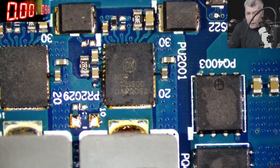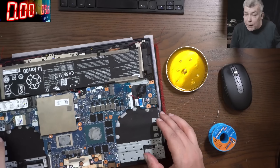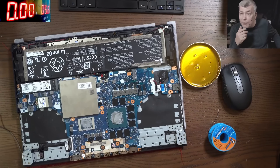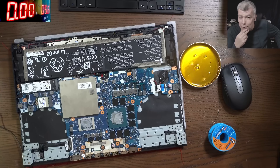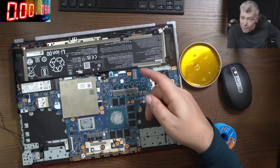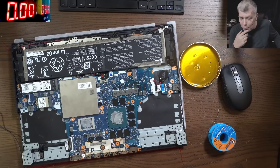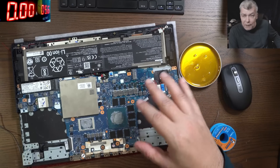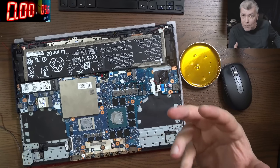After cooling down, we have to check if the MOSFET is working. To check if an electronic component is working you insert an ammeter in serial mode with the tested component and you can see the current flowing through it. The problem is we can't do something like that here, so all we can do is try to use the thermal camera, and based on the thermal signature we can figure out if it's working or not.